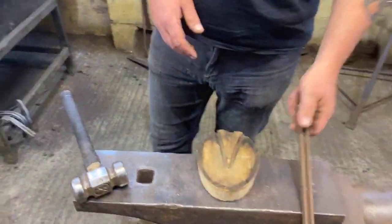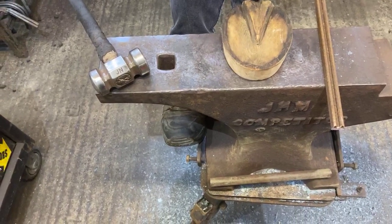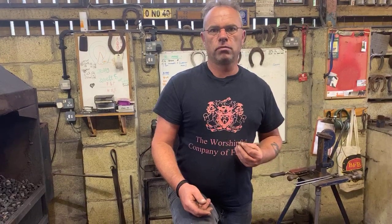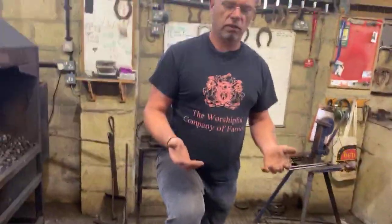So then, the key thing when we're trying to make these preventer shoes, and where most people do go wrong, is the fact they don't put the correct shape into the shoe. Remember, it's an irregular shape. It's not the normal flowing shape that we are used to seeing. It's got to fit a particular way. If, for example, you hand in an anti-brushing shoe for either an NVQ or a diploma board shoe, if it's just a normal flowing shape with the edge knocked off it, then that shoe's going to fail because you've shown that you have no idea what that shoe's supposed to be doing. Okay, so it's important we get the shape right.